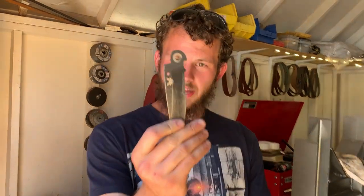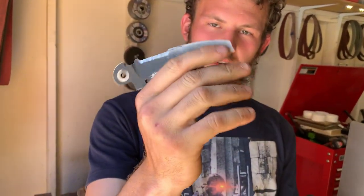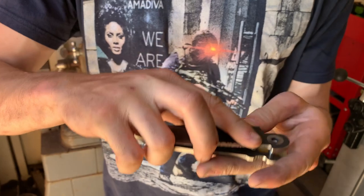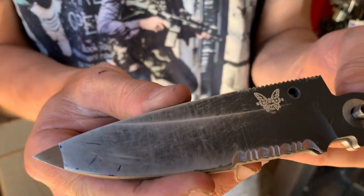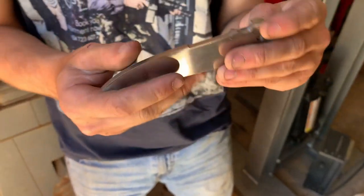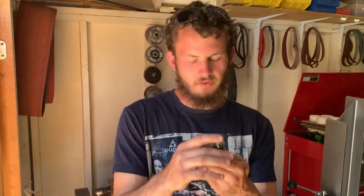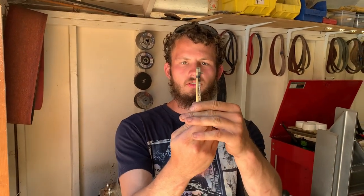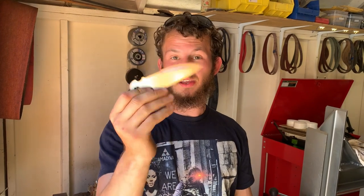We're going to call it here. Just a little recap: here's our start blade with the broken tip, and here's our progress on the Benchmade replacement so far — a little raindrop Damascus. All the rough work — rough grinding, milling — it's all done. Next up is just hand work: we're going to take the carbide burr and file and whatever else, really make this exactly what it needs to be. Our thickness is super close everywhere. Stay tuned because next time we're going to take this beautiful blade blank and turn it into a beautiful blade, and hopefully get the whole thing back together. Thanks for watching — please like, comment, and subscribe. See you next time.